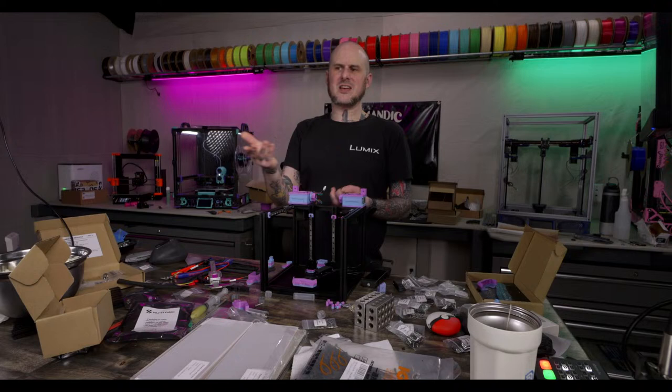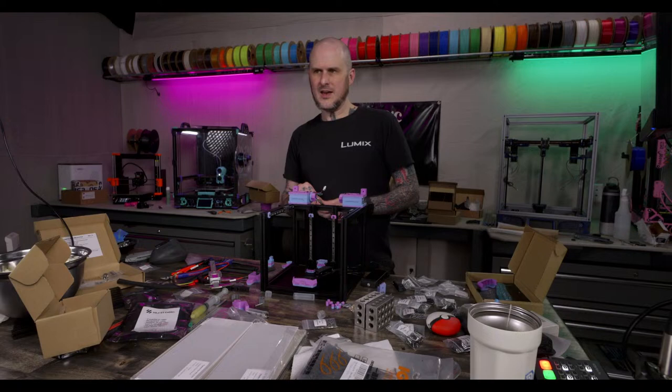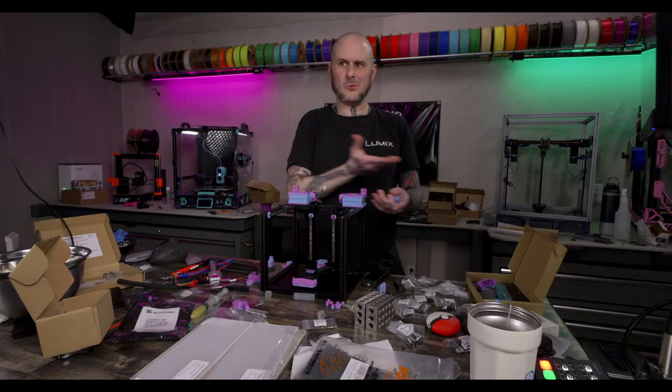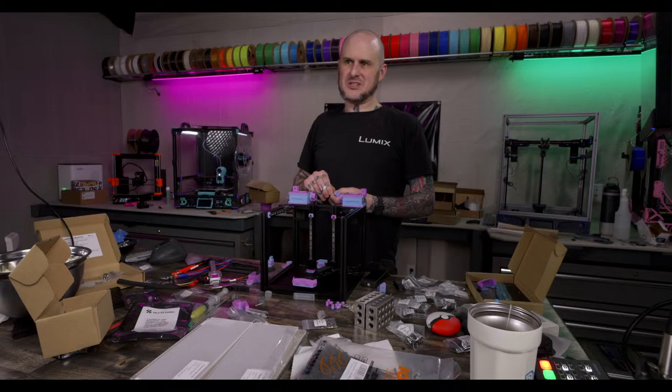He was like, what's wrong with this thing? And he realized that the wind was making the print move and or causing cooling issues. So honestly, even printing PLA, you might want to include at least side panels and maybe an open top so the heat can escape, but you don't get drafts through it. When you're printing for days, there's a lot of variables that we don't have to deal with on smaller printers. I tweeted about it yesterday. Bigger the printer, bigger the problems.